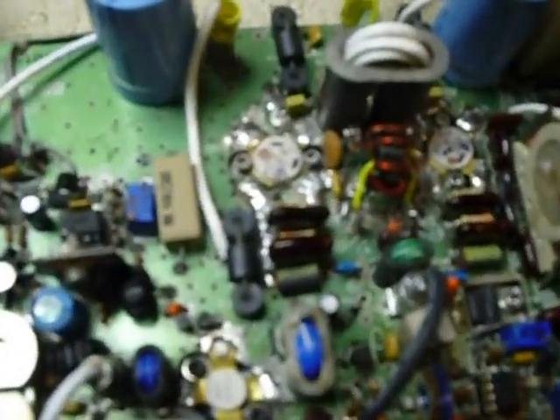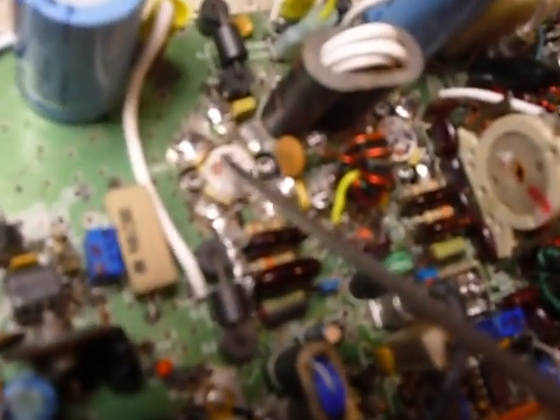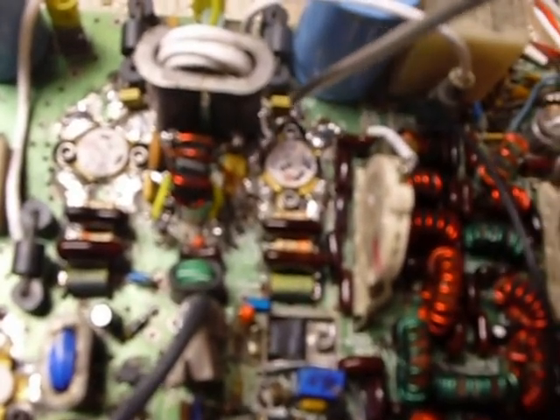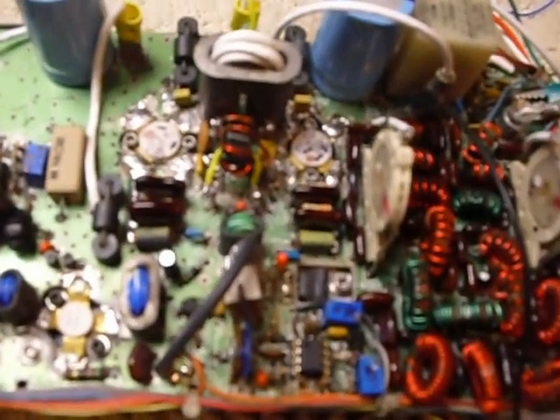Something I wanted to mention: these little capacitors here — there's one right here, another one right down in there — those were chip caps, and those things can crack on the ends and you can't even see it. This thing used to take off and oscillate, and I think that's how the finals were fried. I replaced those chip caps with ordinary ceramic capacitors. This one down here is a 0.68 monolithic, and this one is a 0.01 at 2kV. The secret is to get them right down smack on the board so there is no wire lead inductance at all. I also changed the one behind the transformer, and that solved the oscillation problem in the final.